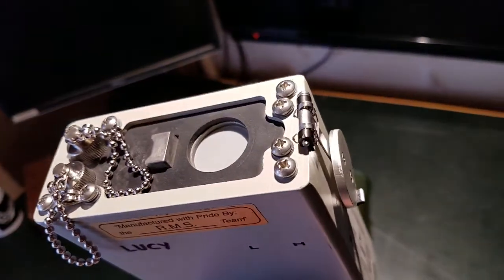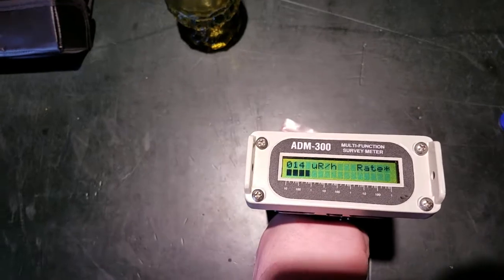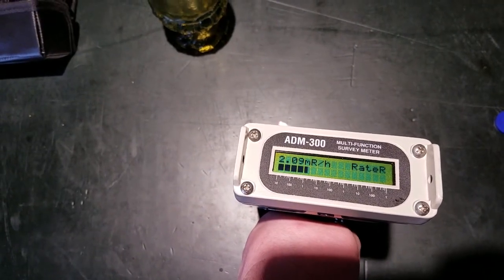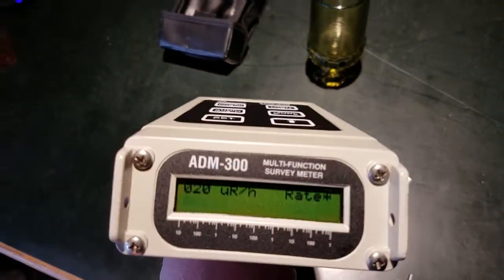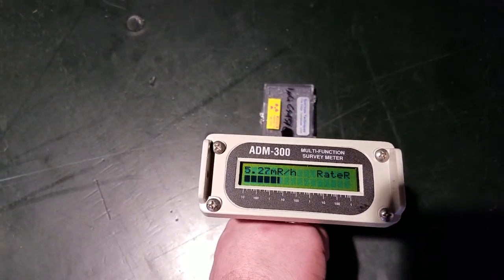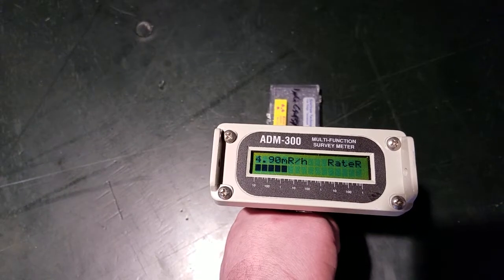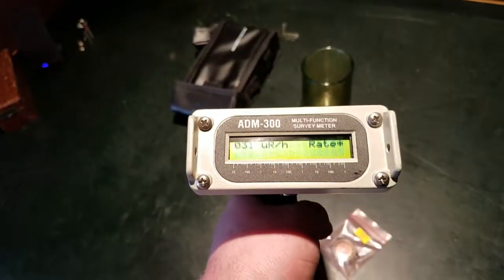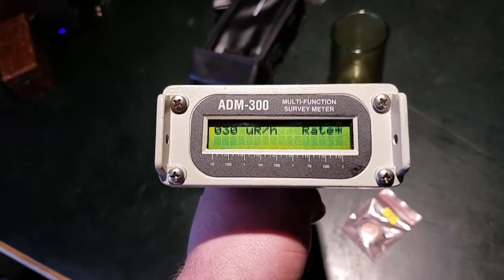It's also worth noting that the beta shield is actually spring-loaded, so when you open it, it pops to the side of the unit so it's not flapping all over the place — which is super nice. So this is the alarm, and it's actually a latching alarm. So even when you've left the radiation field, you need to press a button to clear it — I'll just hit set. That's back down to close to background levels. This is beta plus gamma dose, and you can actually see the counts per minute working on that logarithmic scale. So in terms of distance, there's not a whole lot of visible change from low-level samples to higher-level samples — but that's mostly just because the scale is logarithmic. So you've got to watch out for that.